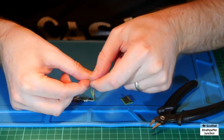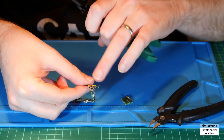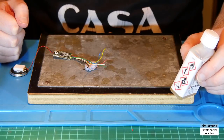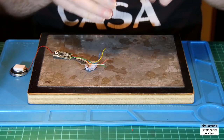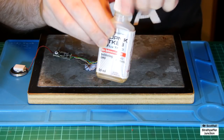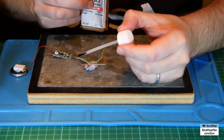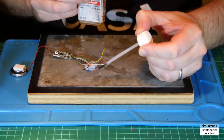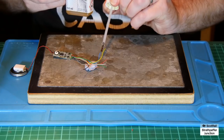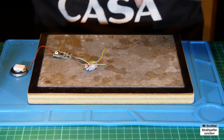What I'm going to do as well is just clean these up and strip them all back. I have my favourite wire cutters here for tiny miniature wires. I'm just going to strip them back by maybe a millimetre and then clean them up ready for tinning so we can pop them onto the adapter. I've stripped back just a wee bit of the sheathing and I'm going to pop on a little bit of liquid flux. This stuff is pretty magic actually, but it's an absolute nightmare if you spill it — I spilled it over the kitchen worktop and had to scrub for some time. You really don't need very much at all, particularly with good flux core solder, but it just helps it flow and means you don't need quite as much heat.